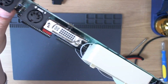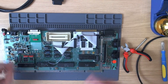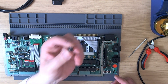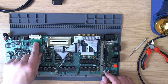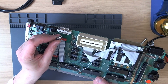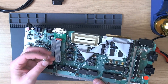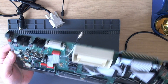Just to give you a good look at how the thing is mounted - it sits perfectly in the case. Now we can put the cable in. I'll probably halve the length of that cable at some point. For the audio jack, I'm going to short out the left and right channels and attach an audio pick-off to one and ground to the other. Do be careful because there are some resistors there - I once let the housing of a stereo jack flop onto these while the machine was switched on and it started to let the magic smoke out, shorting them to ground. I had to replace the resistors, so just be careful about letting anything metallic drop on top.